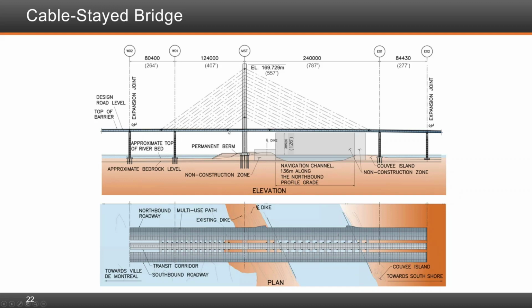Thank you for reminding me, Guy. So the original bid was to have the steel segments be basically brought in. By the way, all this area shows water, but it was all filled during construction. So it was actually land here, all of that. So in this area, it was basically contemplated to erect two false works, and based on that, do a very heavy lift with everything in there. But that was also contemplated to be very difficult, and we switched to the stick building that ultimately was used to erect the backspan.